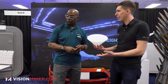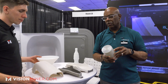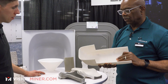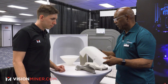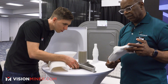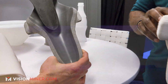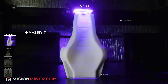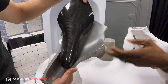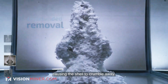You have other materials as well? That's correct. So this one is more of an ABS-like material — it's stronger. And then this one is a UL V0 fire retardant material, so it has the highest level of fire retardancy that UL certifies. And then this comes from our mold printer, which is a different technology altogether. It's enabled by our GDP — gel dispensing printing technology — and it allows us to print a mold within a shell that's water-breakable. The shell falls away and you're left with the mold.